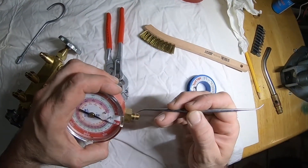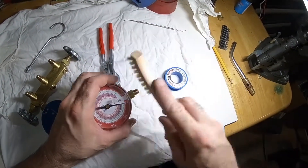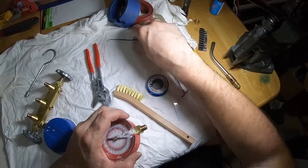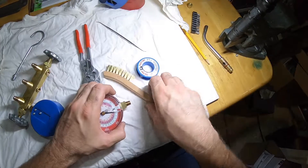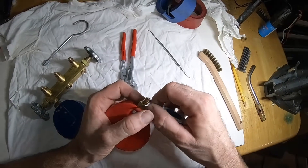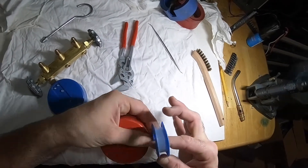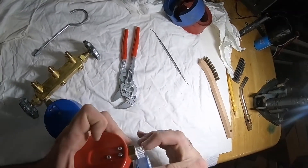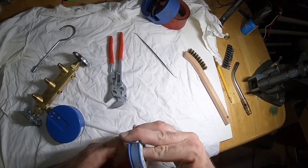My Teflon doesn't want to come out, so that's where a little pick is perfect. I have the whole set of these from Harbor Freight — it's a great buy because it's like two or three dollars, but they come in handy for so many things when you're trying to clean stuff up. I am overdoing it with the Teflon and I know that, but the Teflon creates the seal. Just don't close your hole up with the Teflon or else you're going to have problems testing.